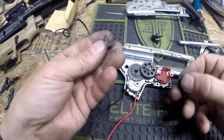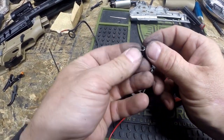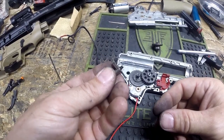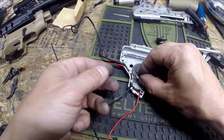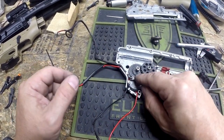This is just a single sector gear. We're going to add another shim to the bottom of it because it does not have a bottom shim, so I'm just going to grab a shim out of the box and put it on the shaft. Now we've got our spur gear and our sector gear. I leave the sector in with the teeth on the bottom so it looks like a smile. Then we're going to add our anti-reversal latch.